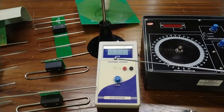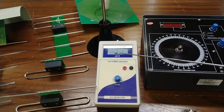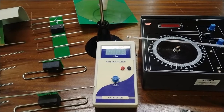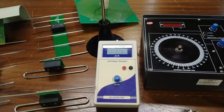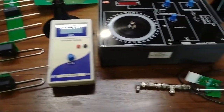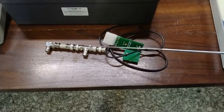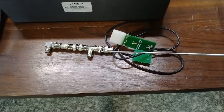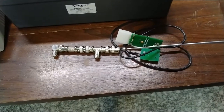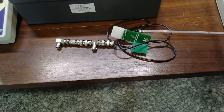Display readings can be adjusted by this level-varying knob. Different demodulator receiving mast and matching stubs are the rest of the accessories. We are also offering some different types of BNC-to-BNC connectors, including two male BNC-to-BNC connectors, an L-type connector, and a T-type connector, which are required to adjust the antennas at different positions.